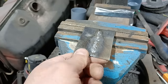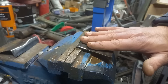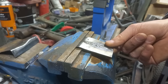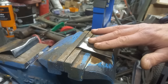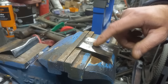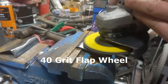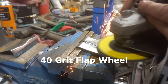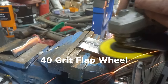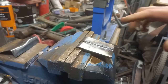What I wanted to demonstrate here is grinding on a panel like this is different. So the idea is to just knock the heads off first of all and come back to it. And as you're grinding, as much as you try to keep these two pieces level to each other, you'll get little micro differences. If you see one side or the other touch, has to stop. When we come to it, I'll show you what I mean. So just knock the tops off first. So that's the top knocked off.